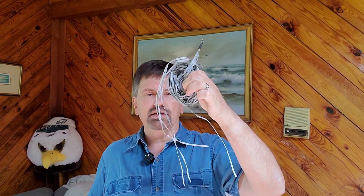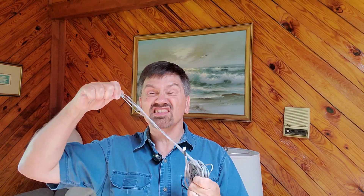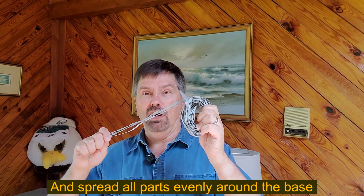The antenna came with about 15 feet of radials — four runs of three conductors of ribbon cable. I found the operation a little squirrely, particularly on 40 meters. What I did was get a spool of speaker wire, stripped off two 33-foot lengths and separated each one, giving me four 33-foot radials, and hooked these up to the antenna. Once I did that, the operation of this antenna was stupendous. I've had contacts all over North America, Europe, South America, and the pièce de résistance — a contact with Antarctica while doing a Parks on the Air activation.